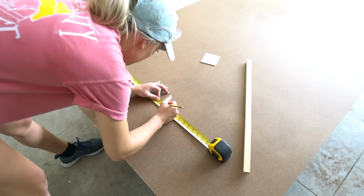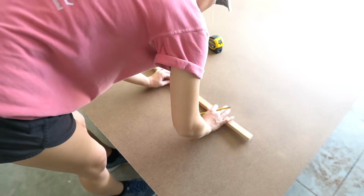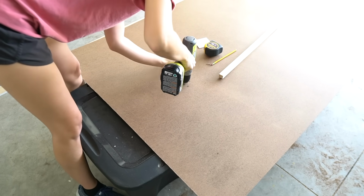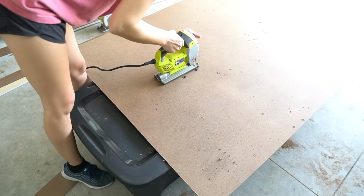I had to notch out a rectangle for the outlet in the wall. Take a measurement on your wall and transfer it to your 1/8" hardboard. Draw a rectangle for the outlet and drill a hole in each corner. Then use a jigsaw to notch out the rectangle.